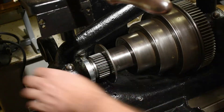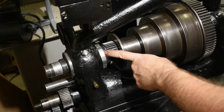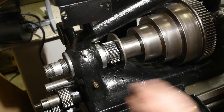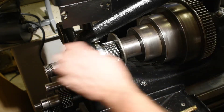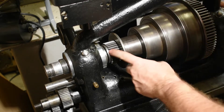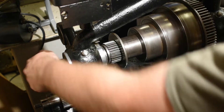We'll see how well it wants to move. So now we're just going to alternate between moving this lock collar this way some and driving the bull gear this way and driving the spindle this way. So as long as this moves freely, you've got some room between here and your lock collar, and you can keep on driving the bull gear and driving the spindle.